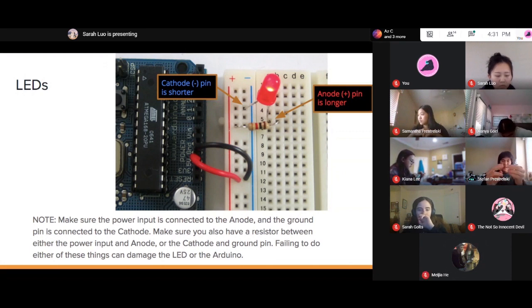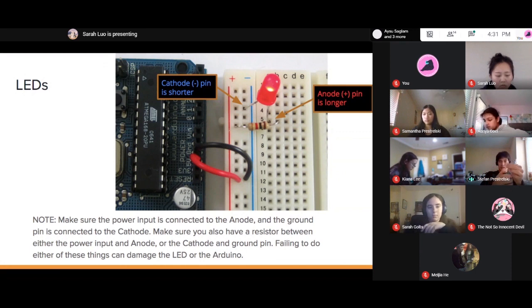So the jumper wires you use, for example, I have this white one here. As long as both ends of it have this little metal tip, then that's the one you should be using. You can use any color, any length that's long enough. It's generally good practice to make the black ones for connecting to ground, and the red ones for connecting from the power.